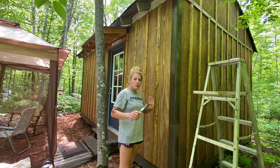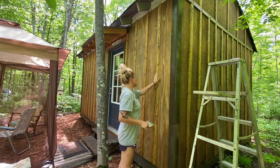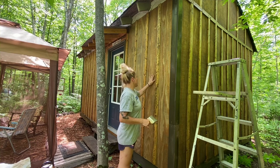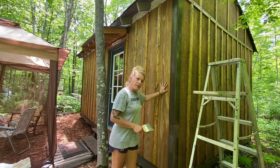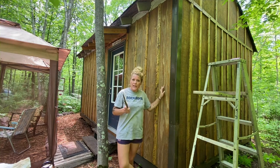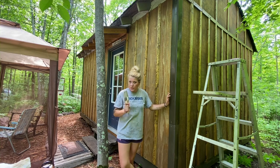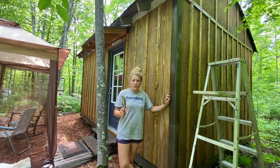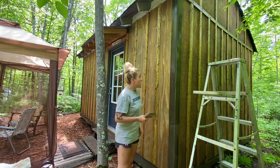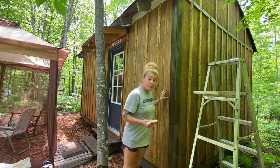First coat kind of dries or soaks in, whatever you want to call it, and it actually isn't even oily. It soaks right into the wood, so that's good. What I have learned in this process is I do like it darker, so I mixed 2/3 oil with 1/3 diesel, and now I'm just gonna put a second coat on the whole entire thing, and it should be done.